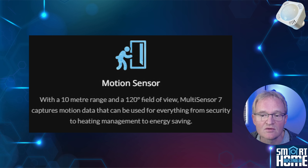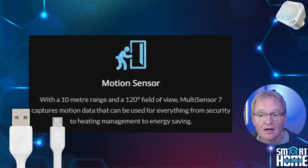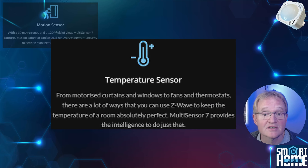The sensor is battery powered for up to two years from the two included commonly available CR123A lithium batteries, and has the option to be USB powered via the included micro USB cable, giving you the ultimate flexibility in battery powered or mains powered operation. Our second sensor is for temperature. You can measure temperatures from minus 10 to 50 degrees C with a reported accuracy of plus or minus 0.5 degrees.